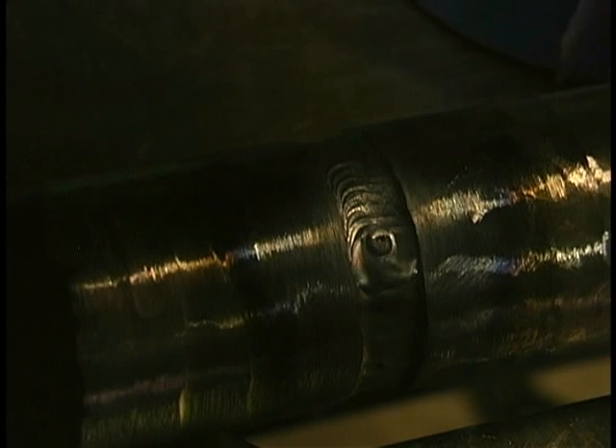Right here I'm dipping in and out. This is another way if you really want to carry a little bit more metal — you want to watch the front of that puddle and make darn sure that you're wetting in on the front of the puddle, dip it in and out. That's another way of doing it, but since this video is mainly about the lay wire, we'll mostly focus on that.